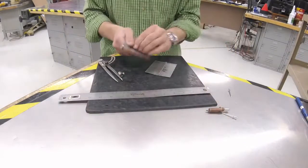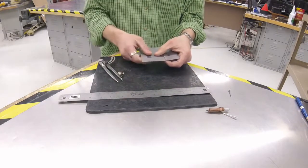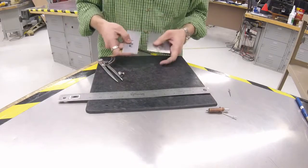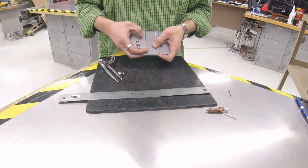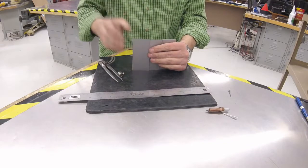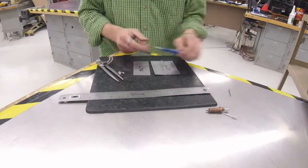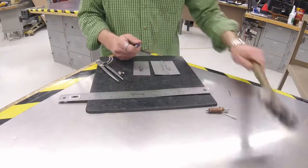We're going to punch four holes — two in this piece and two in this piece — and hopefully they line up when we overlap them and put the rivet through. Before punching the holes, I'm going to set these pieces right next to each other and check that the two lines match up. If a piece of metal is shorter, it's going to be a little tricky, but we can show you how to fix that. Then I'll go punch the holes using the pin punch and a ball-peen hammer over at the stake table.